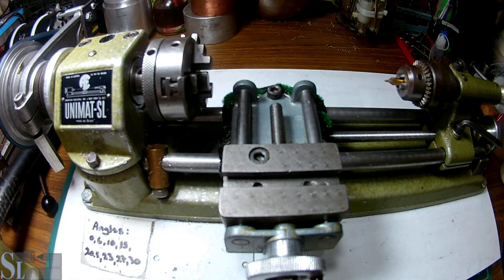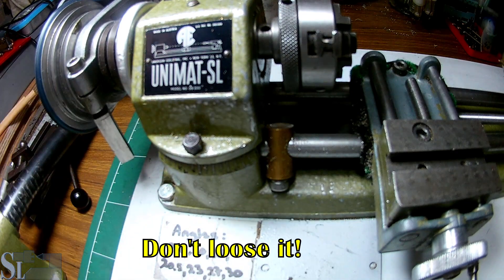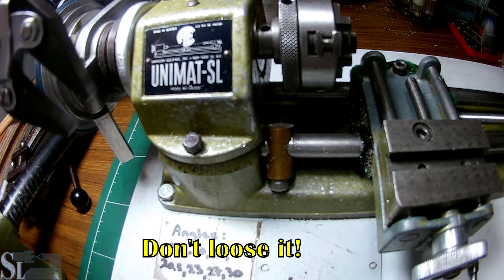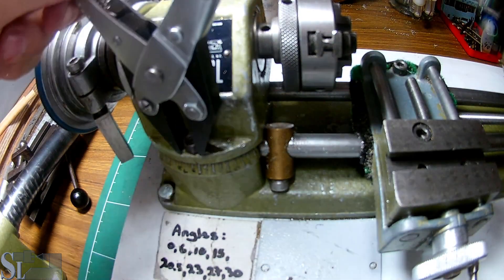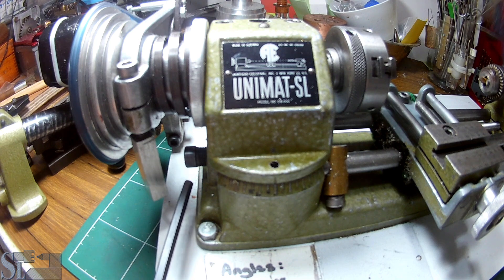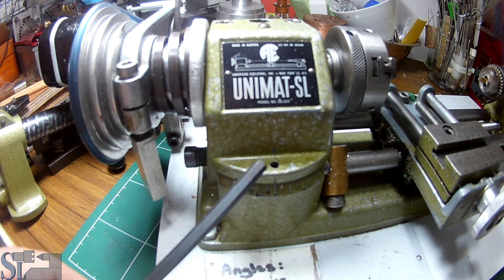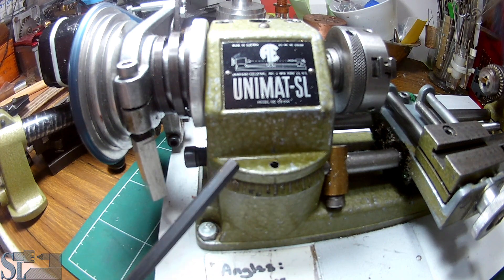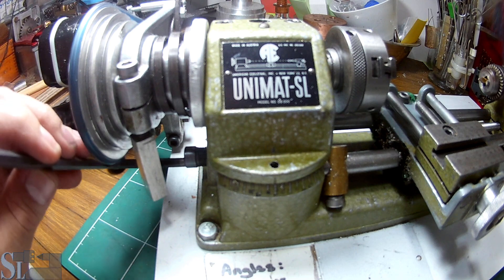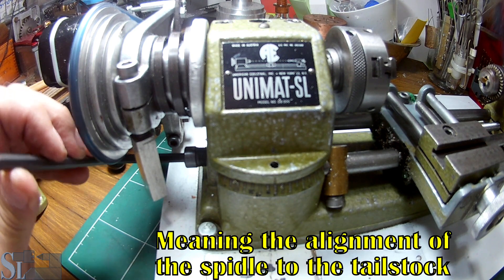First, let's get a higher view. This is a locking pin — take it out with parallel pliers or any other means that won't mar the pin. This thing over here is the locking screw; it locks the spindle to the base and keeps it from changing angle. Once you unlock it, you lose concentricity at that very same second.